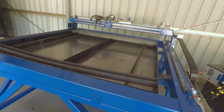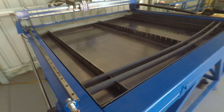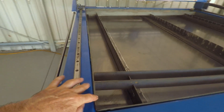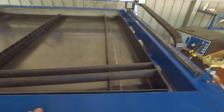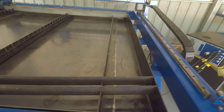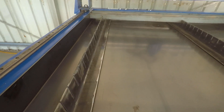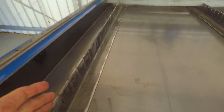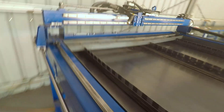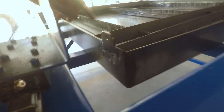That was rather timely — I was just working out how to lift this pan in when my mate Rhys turned up, so we've dropped it in now. The tray is 1500 wide and the inside of the table is 1600, so there's a small gap here and at the back — but the torch doesn't travel that far back. I've lined the slat frames up and dropped a couple of slats in to see how it looks. It's a little bit loose so I'm going to put a couple of little tack welds just to hold that in place.